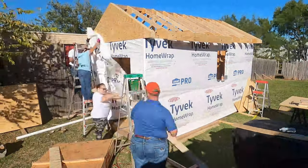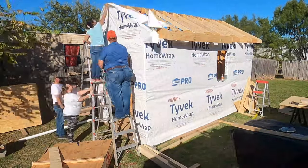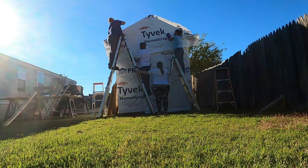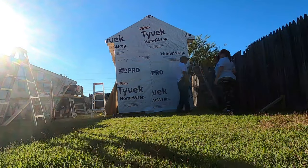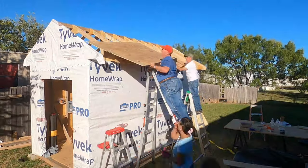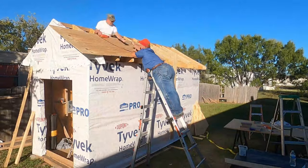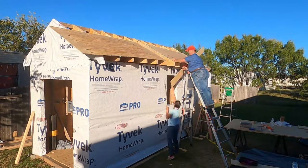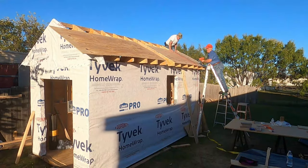Several song-filled hours later, as you can see it was very windy the day we put the Tyvek over the gable ends. We did have this particular sheet of Tyvek come off the few staples we were able to put in at first — that's the main reason why we have some bubbles in there. We also didn't care that the Tyvek writing was not level. Coming up next is the very first sheet of plywood going up on the roof. After seeing that the two sheets of plywood for the front and back half of the roof on each side were not going to land on a truss for a good seam, we decided to leave the center section open and cut custom sheets of plywood to fill in that gap.